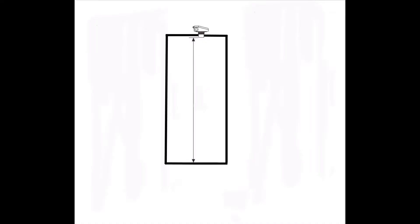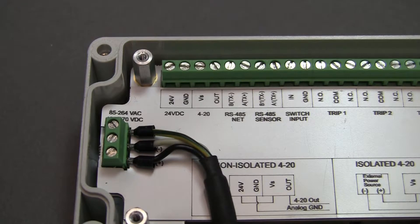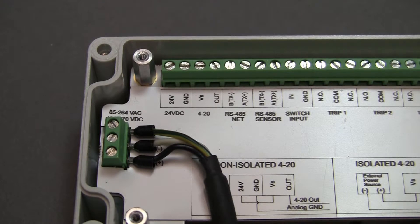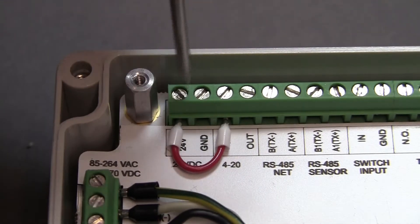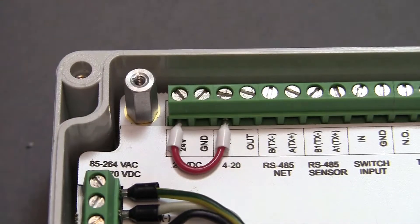Another common application for the DCR-1006A is monitoring the level of material in a tank. For this example, let's set up a sensor to monitor the level of water in a standard flat bottom tank that stands 10 feet tall. For this application, we will be calculating the level based on distance. To control the pump in our imaginary tank, we'll be using an external current meter to monitor the level, and so we'll need to use the 4 to 20 milliamp output from the DCR-1006A. The 4 to 20 milliamp output is on an isolated circuit that must be powered in order to function. To power the circuit from the 24-volt power source on the DCR, install a jumper from the 24-volt terminal to the 4 to 20 circuit's voltage terminal.